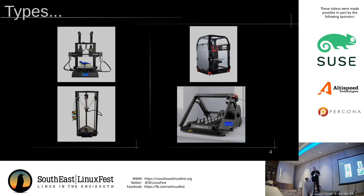Throughout this, I'm going to be using the terms extruder, printhead, and hotend for specific meanings — they tend to get mixed up in colloquial language. For the extruder, I'm talking about the actual set of gears and pulleys that takes the filament and pushes it through the system. The hotend is the metal block which heats up the filament and squirts it out through a nozzle. Printhead is the whole set of components around that. The basic parts of a printer are the bed — that is almost always heated. By the way, in 3D printing, temperatures are always given in Celsius.